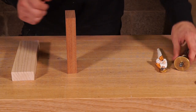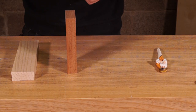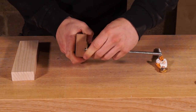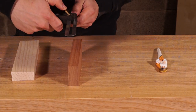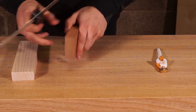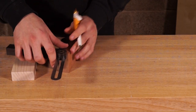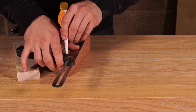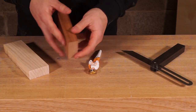Next are the lines along the top to cut the dovetail. We can change the marking gauge setting - it's 26mm, so I'll go in about 3mm from each side to leave a flat surface to get the saw started. Then we get the sliding bevel and mark the dovetails on the end. With the ratios, I'd make them a little steeper - I'd do around one in six. The theory behind dovetail ratios is a little bit pointless honestly, and I'll be covering that in a future video.